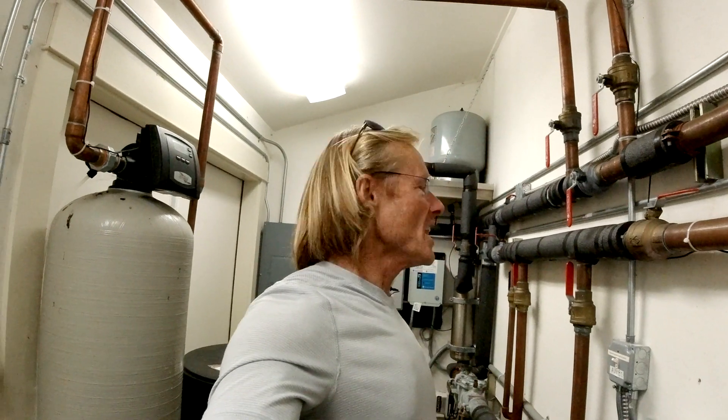This is a pretty elaborate pump room, but it's not the only utility room on the site. We have a geothermal field that handles in-floor heat in the main house and pool building, as well as an air-to-water heat exchanger for air conditioning. We call it the soccer field because it's about that size. In that room we have three ground source heat pumps fed from the geothermal loops.